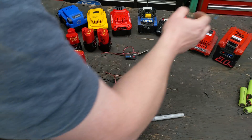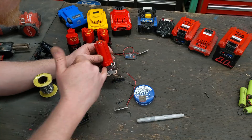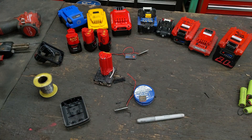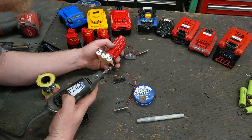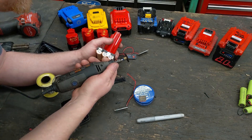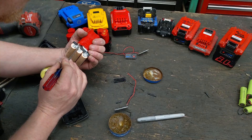Now we'll solder. People will say you can't solder these cells, but we're actually soldering to the tabs, not directly to the cells — soldering to tabs is just fine, that's how they're manufactured. Just don't put too much heat into it. To solder to these tabs, they work way better if you rough them up just a little bit. You can file them or I'll just touch them quickly with the Dremel. I'm using flux so that just helps the solder flow out better.